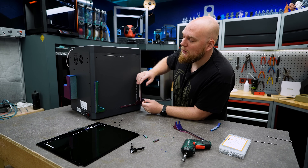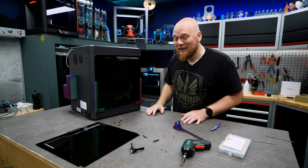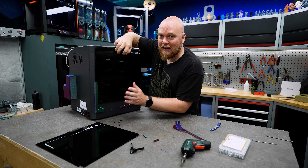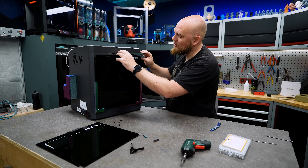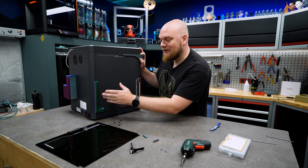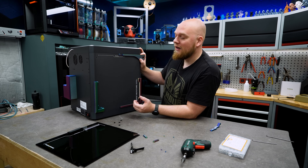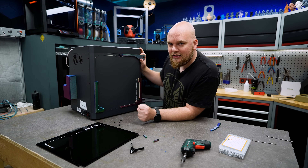And just like that, the mods are done. Now it's time to see what these are meant for. This is the top piece, and this thing should just slide in just like that. Absolutely brilliant. So if you don't want to use the top sheet because you do PLA, I tested PLA with the top sheet - it is fine. The hinge is almost ready; we have one part left. One thing we can see with the tricolor, which is a little bit of a user error, is that we are going to have different shades of color. It's going to be really important that you get the orientation of all the parts about the same so the surface level of these 3D printed parts looks similar. Because if printed in a different orientation, the colors won't be meshing.